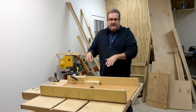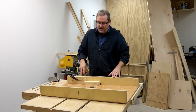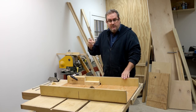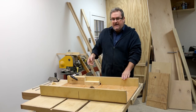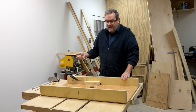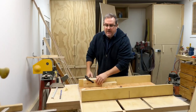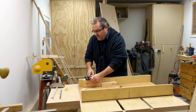The only difference with both methods is that you're able to hold the piece solidly in place — that's the crux of it: controlling the work so it can't move while you're making the cut. People see the sled cut and say that's fine, but if they see the other cut with the miter guide and the fence, they'll say that's dangerous — when they're exactly the same thing.